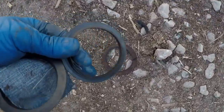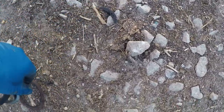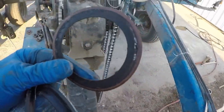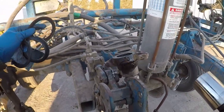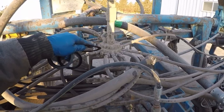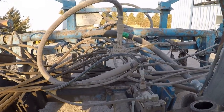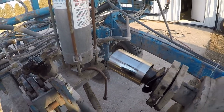I got the gasket or seal out of the other side - it's just all on the ground here. This is what it should look like, and those couple little chunks are basically all that was left. No bueno. The other concern is that since that would be downstream of all the strainers, any chunks that came out of there could have gone through the distribution manifold, so I'm probably gonna pop it apart again, make sure there's no chunks of rubber in there, and blow out the one-inch line that feeds it. But I'm optimistic we can get seals replaced in very short order and be back running.